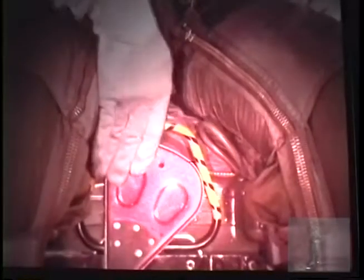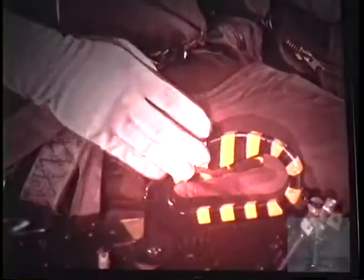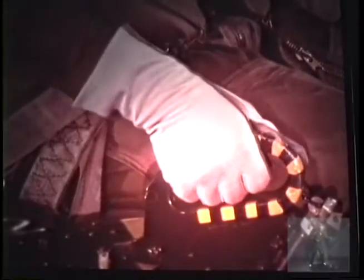The guard, which locks the secondary ejection handle in its receptacle, should always be in the up position during ground operation. The third emergency control is the emergency harness release handle. In a ditching situation, or if automatic separation does not occur after ejection, the emergency harness release handle will release all restraints so that the occupant can push free of the seat.